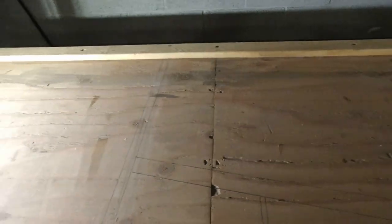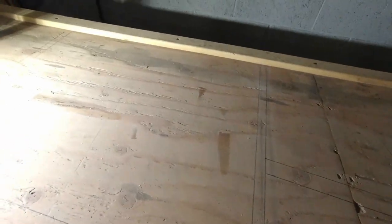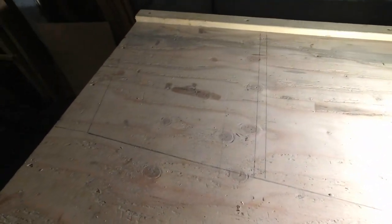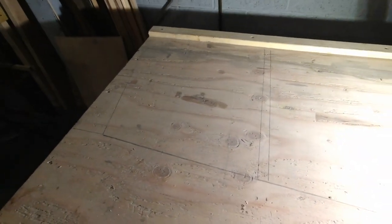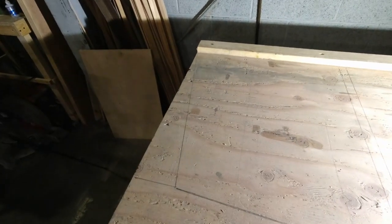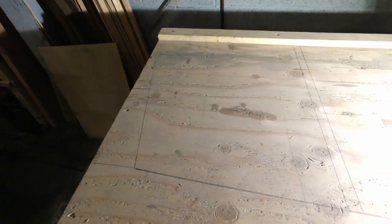Now all the longerons and everything are 3/4 by 5/8, except for when we get forward of here, it's going to change for this half VW. So all right, I'm going to grab the pencil here, grab the drawing, and work on the changes up front here. All right.